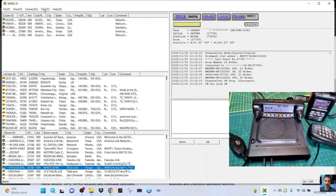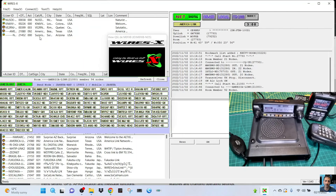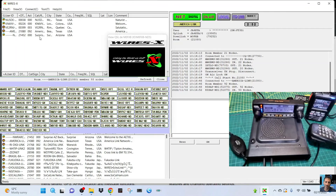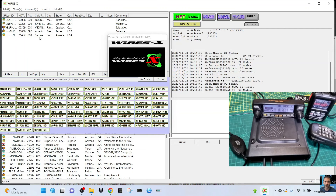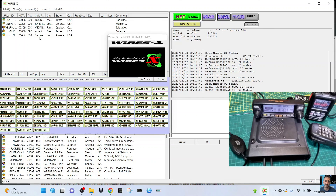There's so much more you can do — you can right-click and connect to rooms, or connect using the connect box. For example, right-click America Link, connect, and audio comes out of the handheld. You can actually use this system with the Yaesu FT5, FT3, and FT2 as well. If it's just the SCU-20 cable, you can use the Wires-X PDN system and also the FTM-400. I hope you find this interesting and it helps you set up your PDN mode. 73, thanks for watching — please like and subscribe if you're finding these videos helpful.